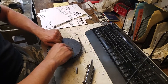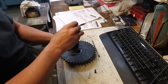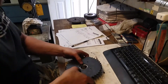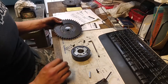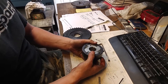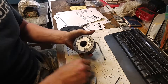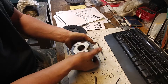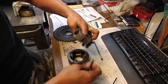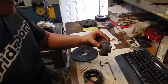I think you have to disassemble this to put it on, which is kind of a pain. This piece — I'm not sure — maybe you can take this bolt out and get to the set screw that is supposed to go down on top of the keyway. The keyway goes in here, set screw right here. That's got to be locked on the shaft.